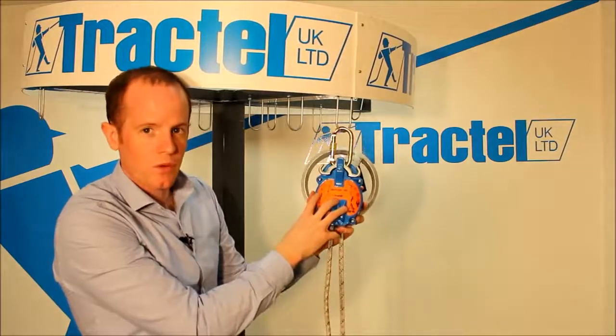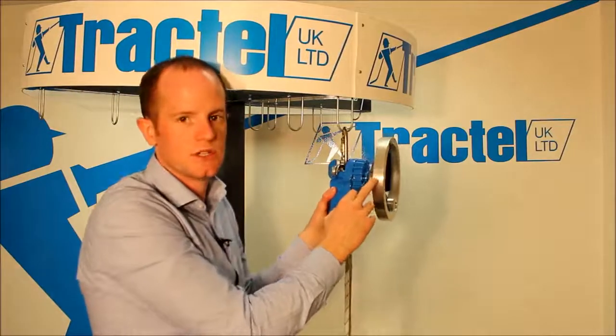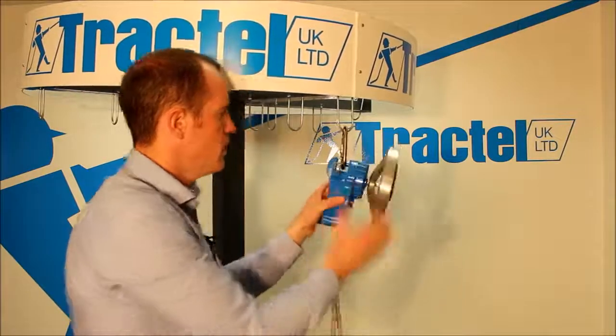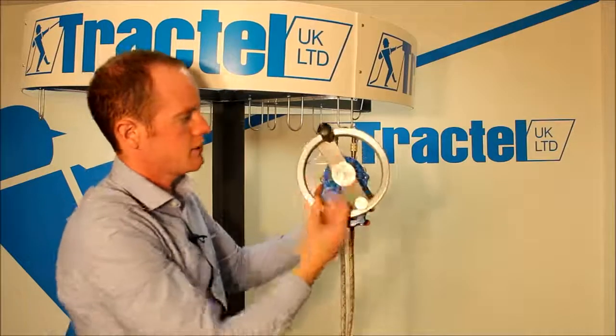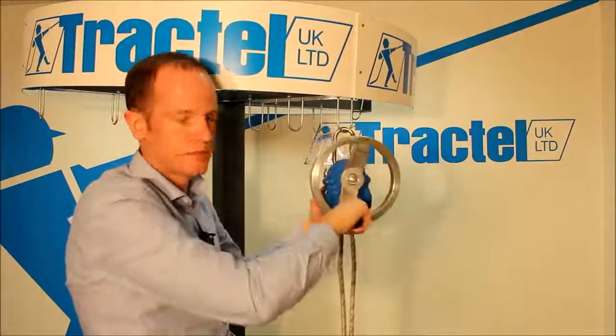It's EN341 for the device, and it also has the addition of EN1496, which is the rescue recovery winch on the rear of the device. With these, there are 2 different ways that we can raise a casualty. First of all is manually. It comes with a handle that just pops out there. You can turn the handle and that raises the person up.